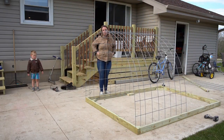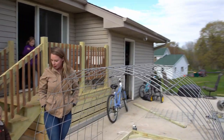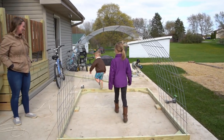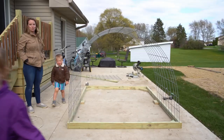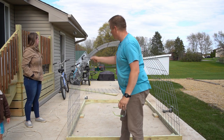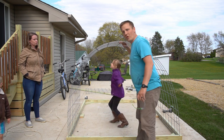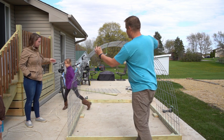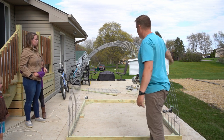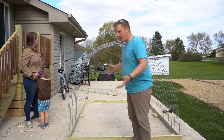As you can see, that's a pretty good fit. I'll bring you over here to get a look — walk under it. It gives you a nice, even diameter. It's going to be perfect for the kids to get in and out. I will be framing a door at one end. My intention is to run a vertical 2x4 up on each side, then cross and connect to a support 2x4 that goes front to back on the top edge. That should help take care of any side-to-side wobble. When we add the other panel on the back side and zip-tie the seams all together, it should be good and rigid.